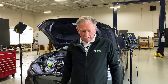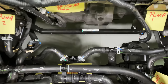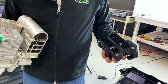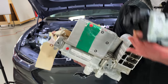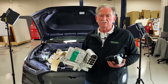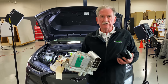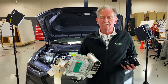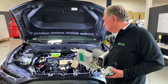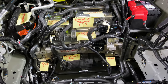When we look at this, we're looking at lots of parts, and these guys don't have too many. So let's have a look at what Tesla had. In essence, this is the octovalve. This is what we call a super manifold, and these are two heat exchangers. These all are in one relatively small package with only a few hoses that go from place to place. That means a lot less leak paths. These leak paths are the bane of construction, especially if you're trying to push a car out every 60 seconds or so. That's what these guys are hopefully going to be doing, because they want to make sure that the customers are happy and there's no leaks all over their floors.